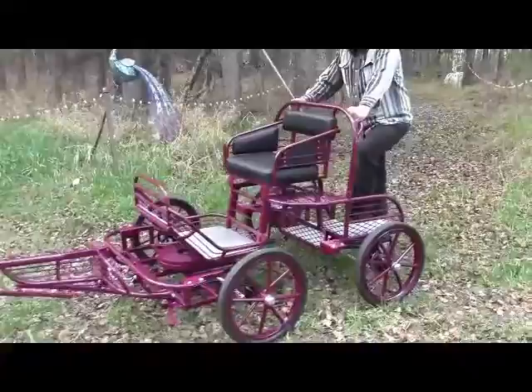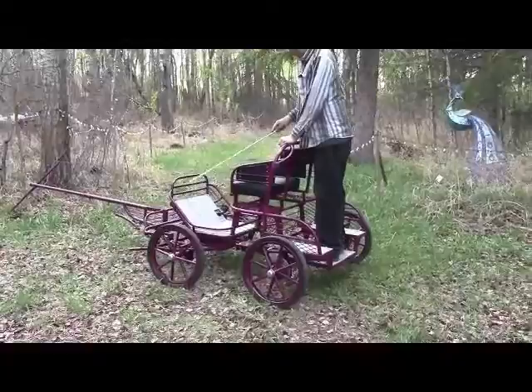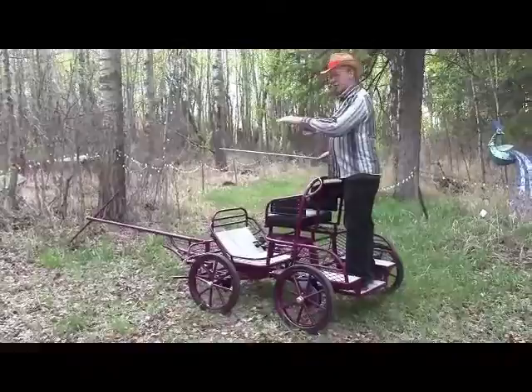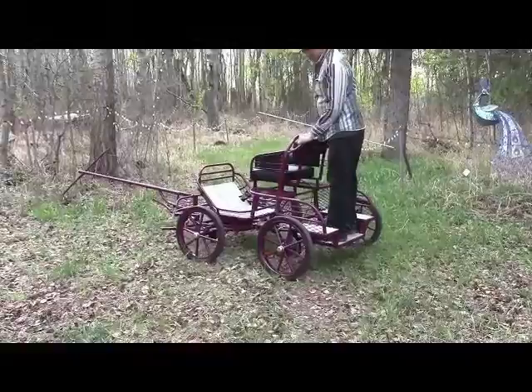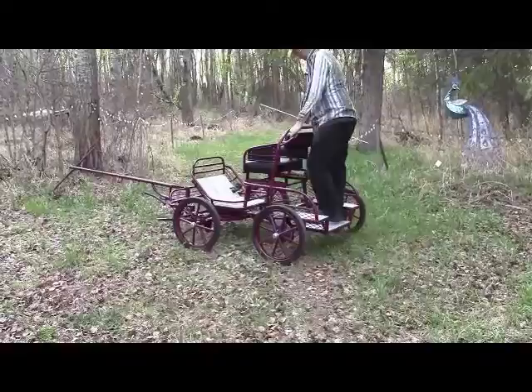Now to the back here, I have a groom platform back here because it is a pair carriage. I've made this as small as I can. This cart carries over half of its weight on the back axle — the reason for that is it makes the front axle a little lighter, which enables your pair, when you have a proper line of draft, to pull that front end up out of holes over rough ground. It makes it ride better because it will float up and over rather than bang into. I've designed some handholds in here so that when you need to, you can really lay some body English onto this cart, and it is stable.